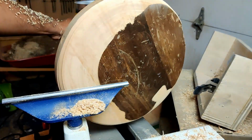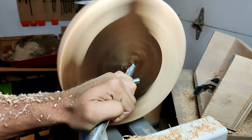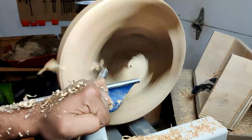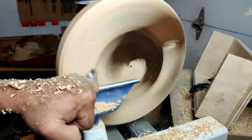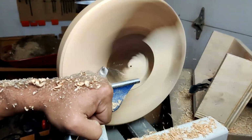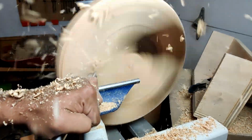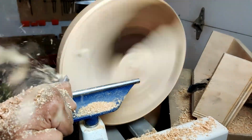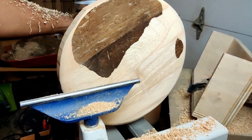Second major thing you will notice is that most traditional chairs, especially in production runs, are not made out of one big slab of wood. They usually take smaller slabs that they can source from different trees or offcuts and then glue them together. Because a seat usually does not experience combined compression forces, a simple glue up is strong enough for most applications.